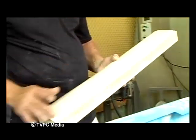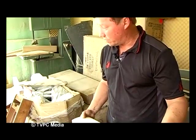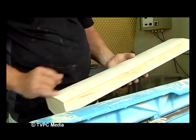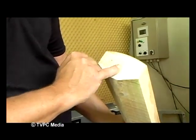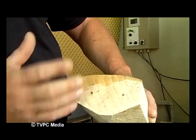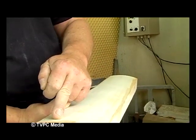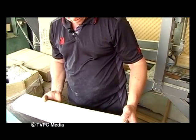From this stage I've got to splice one of the ends and check which is going to be the best end for the handle and which is the best end for the bottom of the bat — the toe. What I look for is how straight the grain runs. I look at the bottom and see how the grain runs through that side. If you turn it around and the grain runs at a bad angle, it's not as strong there, so that's the end I'll put the handle into — you don't want to hit one at the bottom and have it crack quickly.